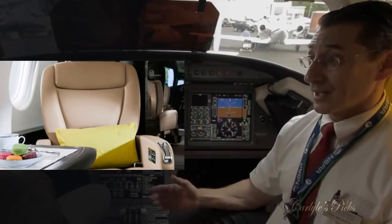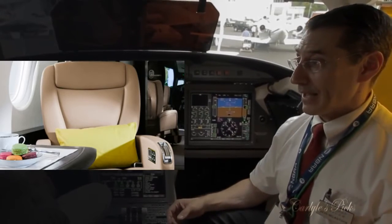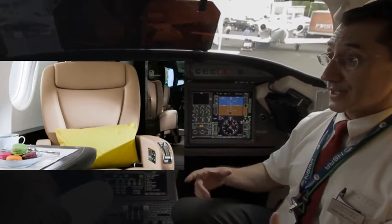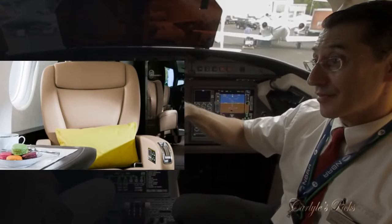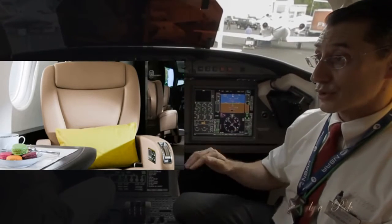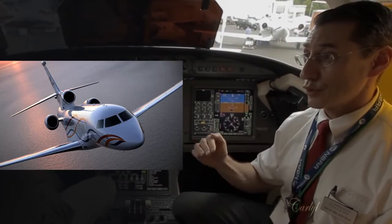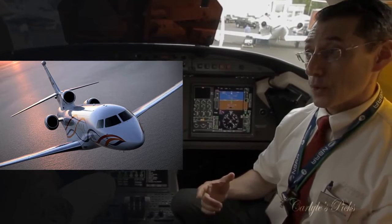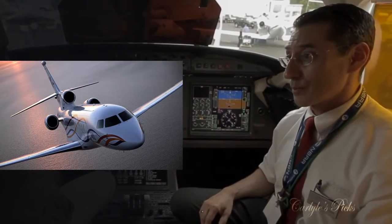The aircraft is very fast. We have a completely new wing — an 86-foot wingspan, more highly swept by 5 degrees than our other wings. It's an aero-elastic wing that provides a suspension effect for a more comfortable ride through turbulence, and permits a Mach 0.85 cruise speed in normal cruise. Our long-range cruise is Mach 0.80, which is what most aircraft cruise at, so we typically cruise at higher speeds.